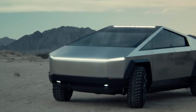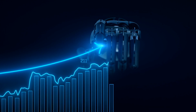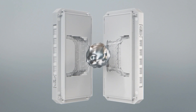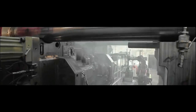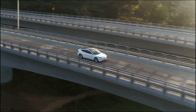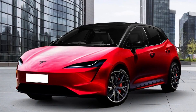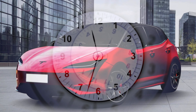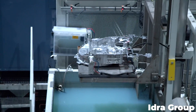So we know that the future for Tesla manufacturing is the Gigapress casting process — the only question is how far they can take it. With the coming production of the Cybertruck, Tesla is installing an even more powerful Gigapress machine in their Austin, Texas factory, now reaching 9,000 metric tons of clamping force. The reason to increase strength is to increase the size of the die casting mold, so the casted component of the Cybertruck will be 50% larger than the Model Y front casting. As for whether Tesla will ever be able to form an entire vehicle frame with a single machine — that will be preposterously difficult to achieve, but we can't rule it out. The company will soon be revealing details on their next-generation vehicle platform, a car smaller than the Model 3 that can be manufactured at twice the speed for half the price. Giga casting will inevitably play a major role in accomplishing that feat.